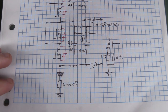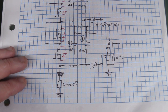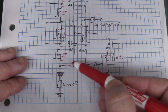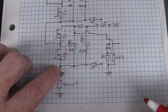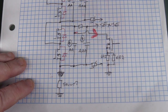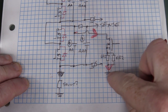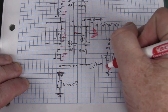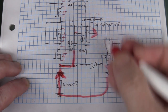They can just measure the voltage drop across those discharge resistors. Now some of you might wonder: why did we see the current change direction through the main current shunt? It's easy: during charge, current flows down through the MOSFET ladder and through the battery, so it passes through the shunt in one direction. During discharge, current flows out of the positive terminal of the battery, through Q25 and the discharge resistors to ground, and then back through the ground plane — so it traverses the shunt in the opposite direction. That's why the current changes direction. Kirchhoff's current law: there must always be a loop.